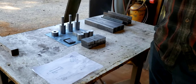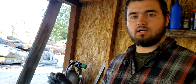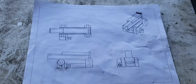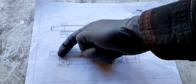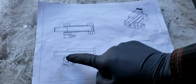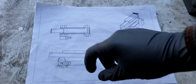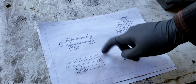There are different settings so that the difference from end to end stays constant. He wanted one side to be 3/4 inch and the other side to be 1/4 inch. The way I did that is it's cam operated — there's an offset lobe, and when you turn it it lifts up and down. To set the different sizes there's a bolt that you can put in different selections so that as you crank it, it stops at the right size.